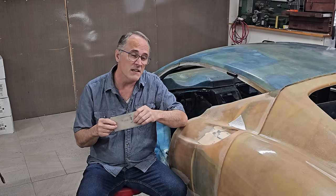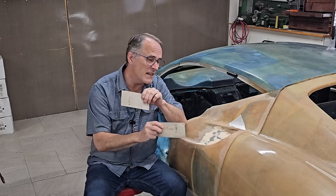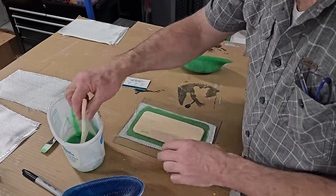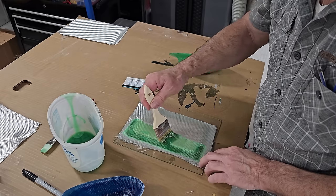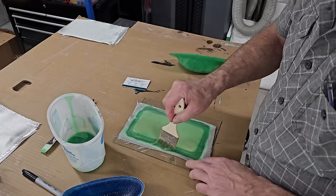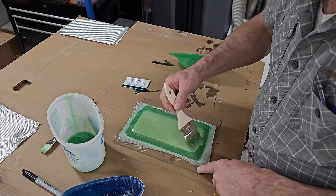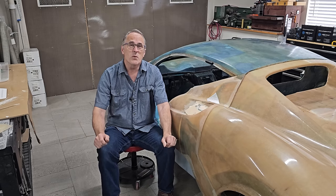Multiple layers have some layers in compression and other layers in tension - not just the individual fibers of the bundle acting in compression or tension. Just like those loose fibers, we bond multiple layers together and we're starting to get a very strong panel. Another trick is that the further apart the compression and tension planes are, the stronger the beam. We can laminate a piece of foam between layers of fiberglass, adding more rigidity - the same theory as an I-beam: two masses separated by webbing, one under compression and one under tension.